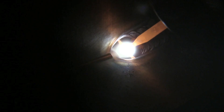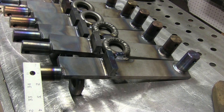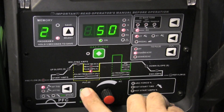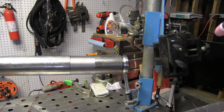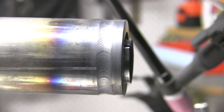The DC arc from machine to machine — I don't notice a lot of difference. Any of them do okay on DC, especially if you're not pulsing. Here I'm at about 170 amps doing some parts that got black oxide coated — a good money-making job this machine did well on. This is the job where I did 50 parts using the pulse feature: 40% pulse on time, 50% pulse amps, pulse frequency at one and a half pulses a second. I put it on a turntable, held the torch still, and did this a lot of times. It made for some good-looking parts.